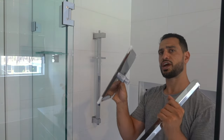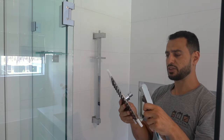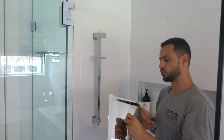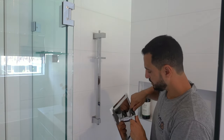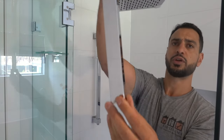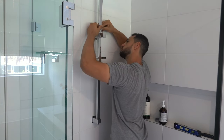Now we're going to install the actual shower head to the top rail. You can install the rail first and the head on top, but then you'd need a ladder, so instead just unscrew the little cap and thread the shower head on, making sure the rubber O-ring seal is always inside. Thread it on by hand first, then follow through with an adjustable wrench just to make sure it's nice and snug — don't over-tighten as it has a rubber seal that just needs to clamp down. Then slot the shower head over the top of the rail and tighten the two grub screws at the back with the allen key.